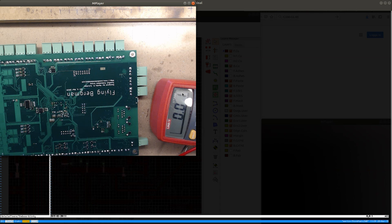I could do a little test to check if it's really the CPU. I wonder if I have any CPUs in this package that I could solder. Otherwise I would just solder the working chip from the motherboard, which I already made, where I already enabled all the power rails and gotten the chip to work. So maybe I'll just desolder it from that board and put it on this board and make sure that this board is working as well. And then we can be sure that it's the fault of the chip and not something else.